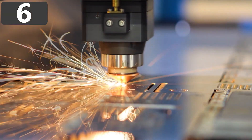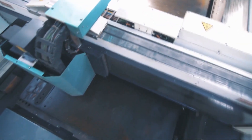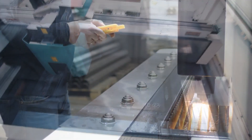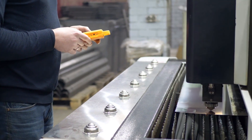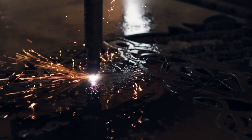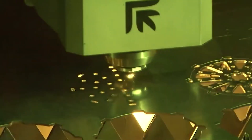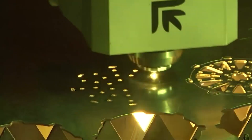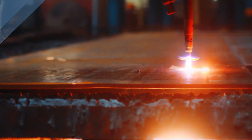Number 6: Metal Laser Cutting Machine. Metal is a material used because of its strength, but this can be a problem when manufacturers need to cut specific shapes into it for a project. Luckily, there's a precise solution: a laser cutting machine. At first these were only really used in large-scale operations, but they're now affordable enough for schools, smaller companies, and even at-home hobbyists. While there are a variety of different types of lasers, the most common one for metalwork is the CO2 laser — the highest-powered type of continuous laser available — which produces a beam of infrared light that cuts through material.